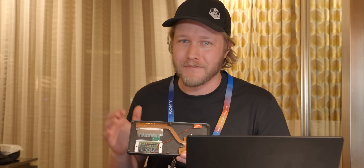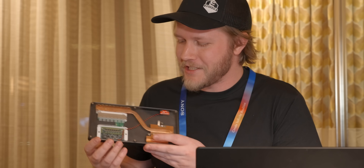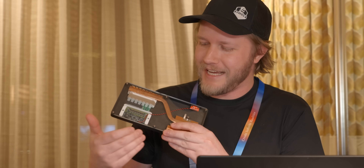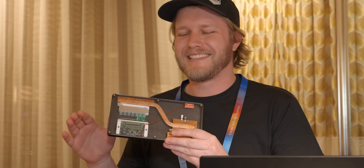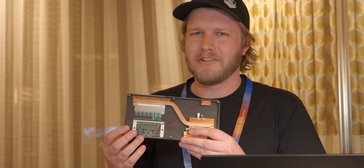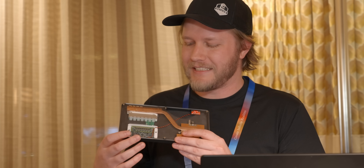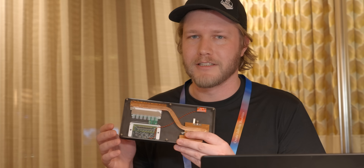Two problems though if they want to make this an actual product. First of all, powering the thing — it's 5,000 volts, so that can be an issue. This right here is a pretty typical step-up converter; basically you go from 5 volts to 5,000 using a bunch of electronics. This one as it stands is about 60% efficient, and that nets you compared to a normal fan something like minus 20% efficiency. Dell says currently that's about a wash for power, because since it is smaller than a traditional fan they can add more battery. At the same time, theoretically this could be 80 to 90% efficient, and they do think they can get there, which would bring it just about even with a typical computer fan.